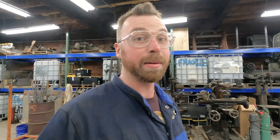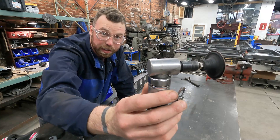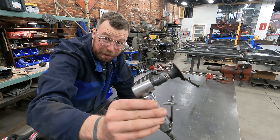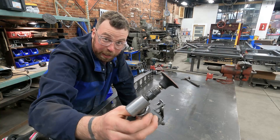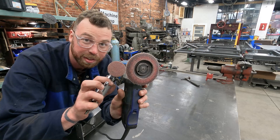A lot of the final cleanup I did with this guy — it's a 90-degree die grinder with a sanding disc on it. This is slowly becoming my favorite tool. These are useful for everything because most die grinders with the carbide bits are a little too violent, and you can't always get these into little tight spaces. So it's nice to have something smaller. Size is not everything. It's a thunderstorm — can you guys hear that? I haven't had a good thunderstorm in a while.